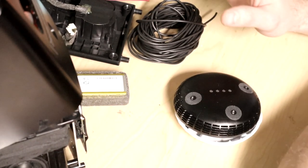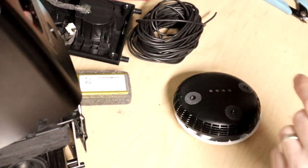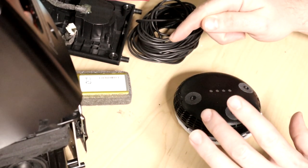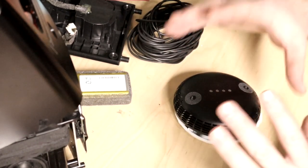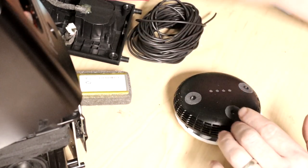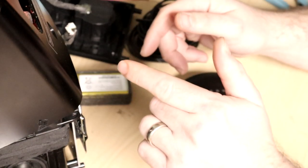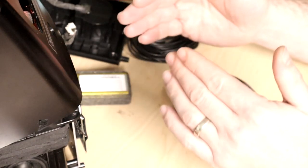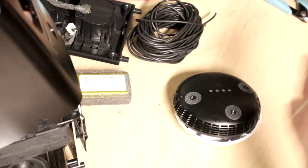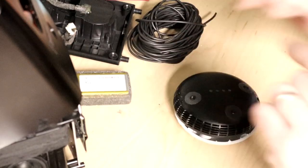Some success and some failures to talk about. I did test this battery by taking some leads and connecting them to the power source of the Nest Mini and it did power up even with only 8.5 volts in that battery, even though it's a 12-volt system. Right now I'm trying to drain down the battery some more to make sure it'll still run off an even lower voltage, and also trying to figure out what boards need to be on the old Insignia to run the battery management piece of it.